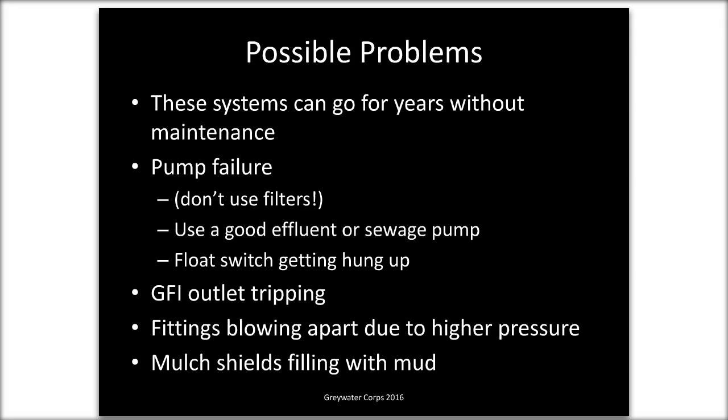In that context, people are irrigating with drinking water. So what we're trying to do, instead of pumping drinking water 450 miles across the state to water your plants, we wanted to pump it 20 feet up into your backyard. So in that context, gray water is a fantastic deal. But yes, there is a small amount of electrical consumption based on the pump going off. But it's only on when it cycles. When someone's taking a shower, it'll cycle on and off a few times.